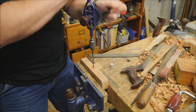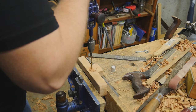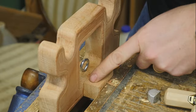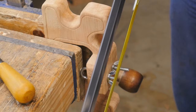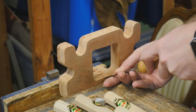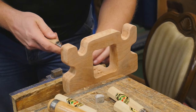The last thing is putting the hardware in for attaching the cutter. I'm drilling two quarter-inch holes through the back of this into the opening so I can put eye bolts through. These eye bolts need to be recessed a little bit into the body so that the cutter can pull them tight against the back wall. I'm using a very small gouge — or you can use an eighth-inch chisel — to work out either side until the head fits down in. Then I'll cut off the excess on the bolt. If you have a Veritas cutting iron or another one from another company, you can put a groove in the back here for the back of the Veritas iron to fit into — it's a simple diamond shape — and when the eye screws pull it back in, they'll pull it tight into that groove.